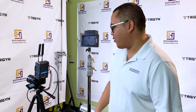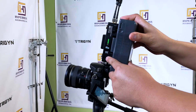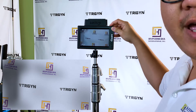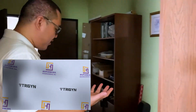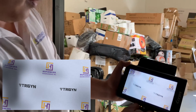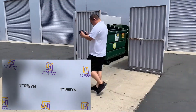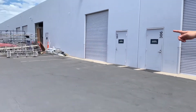The scanner told us that channel 6 is the worst and we should stay away from it. We're now going to set the transmitter and receivers to channel 6 and see if it's any different. We already have a little bit of noise, and as we move it's cutting in and out and it's really, really pixelated. We walked a lot further with the best channel.